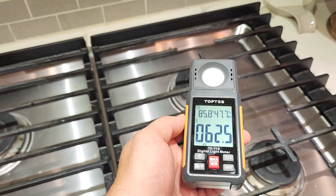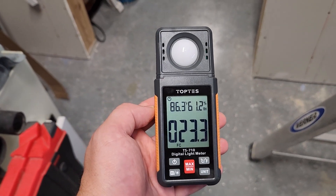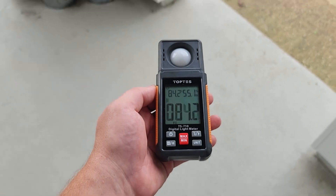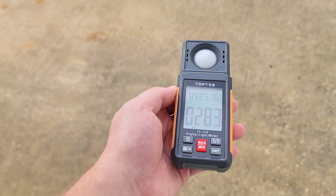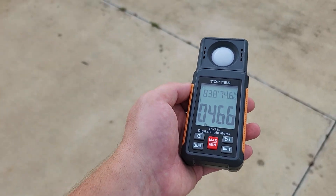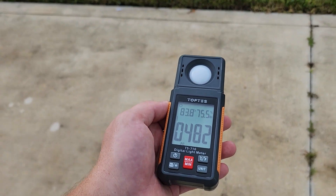The current state in my garage was about 25 foot candles if I was standing directly underneath the light, but at the workbench I was only getting 15. I guess I live in a cave. I also took some measurements outside on a partly cloudy day and was still getting 400 to 500 foot candles wherever I went. Like I said, my shop needs to be bright, so I wanted a minimum of 100 foot candles wherever I went in the shop.